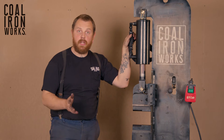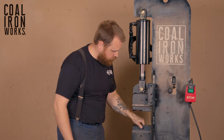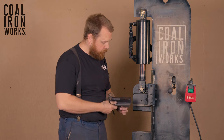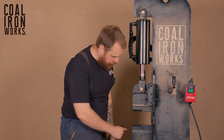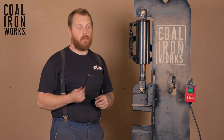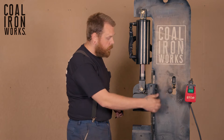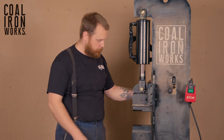We have a single tenon die attachment. To install your combo dies or any die set that we offer, you just drop your dies in, align them with the front, and tighten that set screw. We even include a 5/16 allen wrench with every press that will allow you to tighten the dies and all of your bronze adjustment screws on the machine.